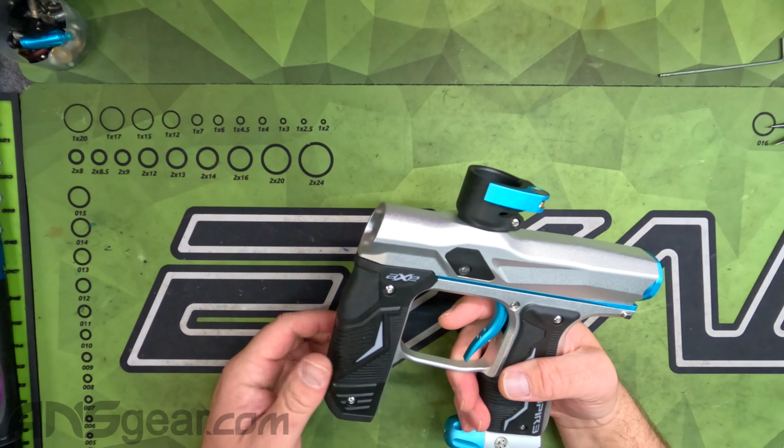and put that in there. I'm going to put a little bit of extra pressure on that, and I'm going to pull this out. And then I'm going to look to make sure that my core hasn't shifted. Because if you use an Allen key that's too small, there's some play in there, and it will allow the core to rotate just a tiny, tiny bit. And then when you try to go put this in, sometimes you push it down and it'll get jammed in there. It'll wedge because the core is rotated just a little bit.